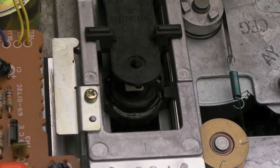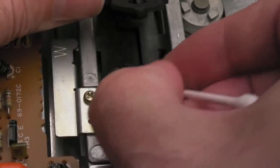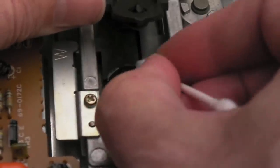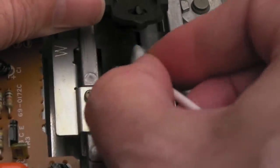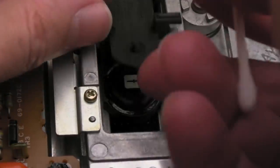I don't really like the word abrasive because this stuff isn't really abrasive in the sense of sandpaper. It's just abrasive enough to polish - to make a surface super smooth and shiny and remove any impurities clinging to the surface. IPA often will not bring those off. That's why I always go for this two-step approach now. Also clean around here as well because you get bits of stuff flying off onto that as a result of the friction on the head. I don't think we need to demagnetise this. I'll use a fresh cotton bud and then go and test it before I do any more cleaning.